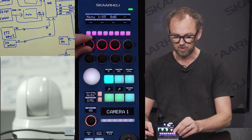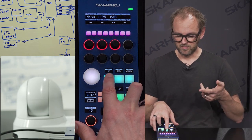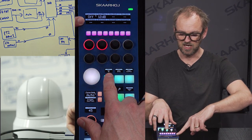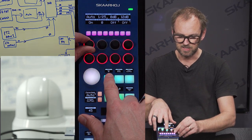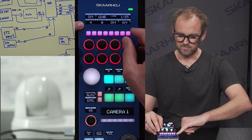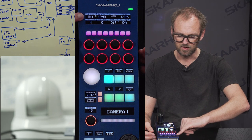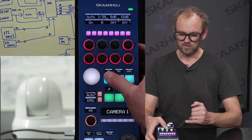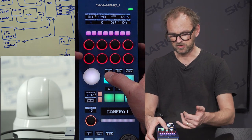Going back to manual mode, the menu can also be toggled. Pressing this button multiple times takes you back and forth between a menu with exposure settings and one with gain point settings. Those would be advanced settings. In auto mode you can see the maximum shutter speed, the minimum shutter speed, and the speed of auto exposure — along with the three settings from the original menu, so five things total appear when I toggle to this point.